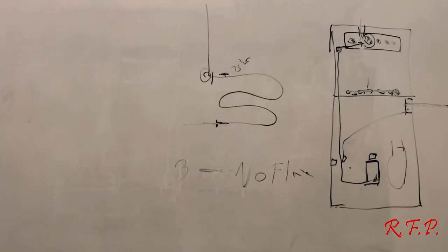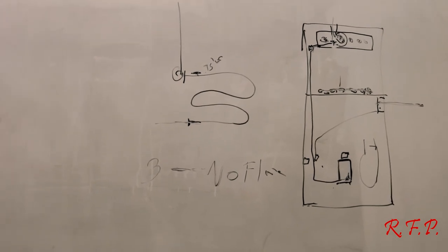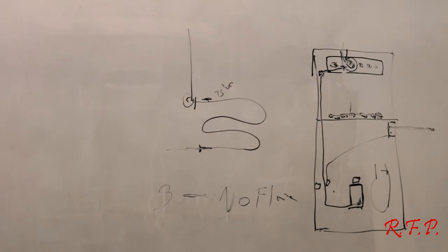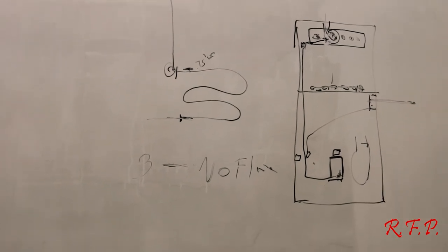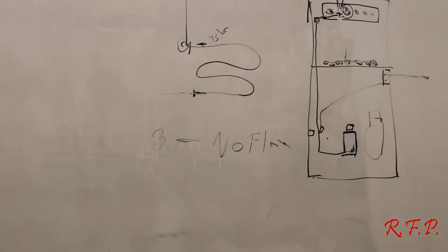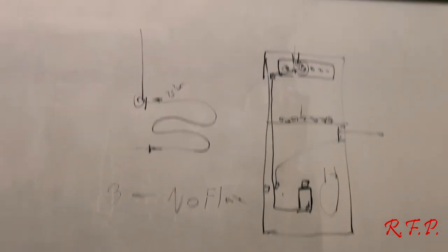But so passing, it's got to pass the flame current. Dirty ground, and typically if you don't get it out of them two, your path's not good. If your path is good and you got a good ground, typically if you don't get them two, the board may be bad. I was thinking of a third one, but I don't remember actually a third one right now.